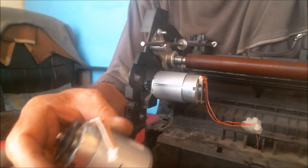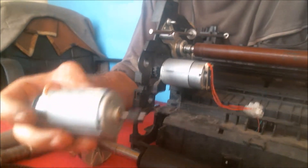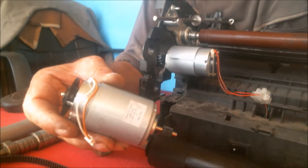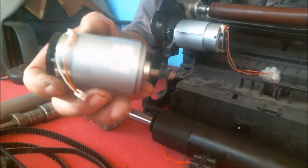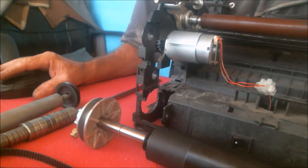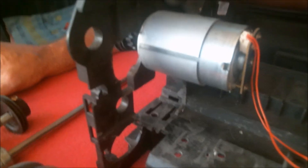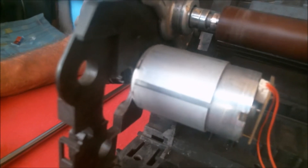The motors — I have tried many different motors from food processors, hand mixers, and others, but the best are these little direct current motors from printers. They are big in size compared to others and run on 12 volts with a transformer, so the cost of energy for a machine that has to run for hours on end is very low. I have not found any alternating current motor with less than 100 watts, and 100 watts is too much for my budget. These little printer motors, at least the bigger ones, are very strong and with the right transmission elements can be very efficient.